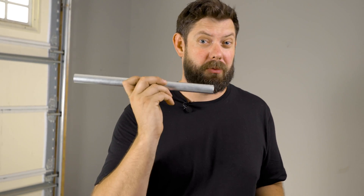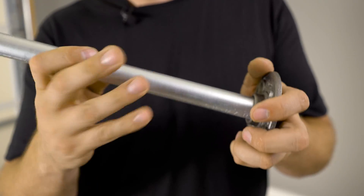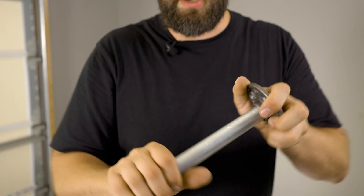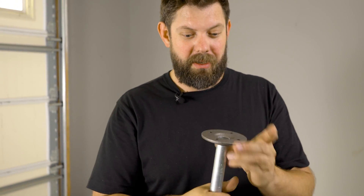The first one is super simple. It's taking three-quarter-inch EMT conduit and simply threading it into the pipe flange just like that. Believe it or not, it fits — pretty good and fairly tight. Is this going to work in all applications? No, but it's a great start. You're ready to mount this and start building off of it.